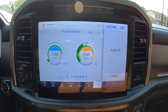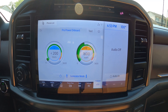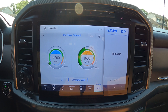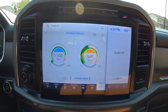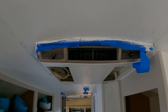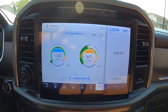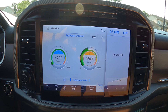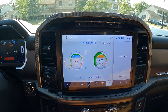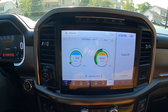That matches up well with what we noticed in our previous video. With the inverter charger in place and the batteries relatively well charged, the draw is the same — a little bit of losses through the inverter itself, but not much. Let's bump it up to medium and then to high. We've gone from 1500 watts to 1700–1800 watts, from about 12.5 amps to about 14 amps, just by increasing the air conditioner from low to medium.